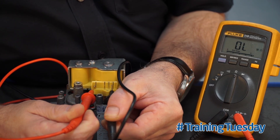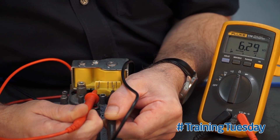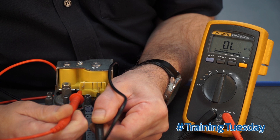Stay on the top pin, go to the next pin up — again there should be a measurable resistance. If either of those paths read open line, the gas valve is unserviceable and needs replacing.